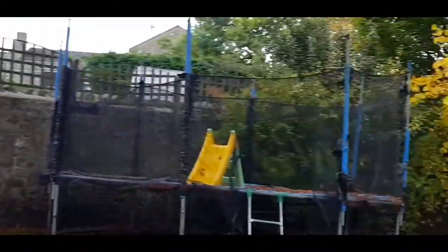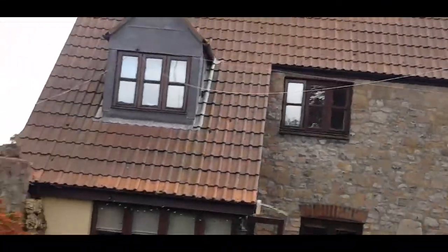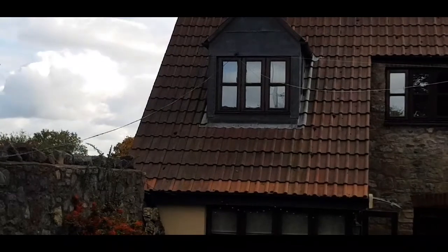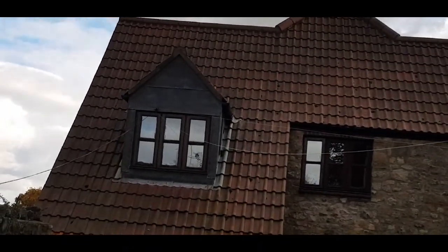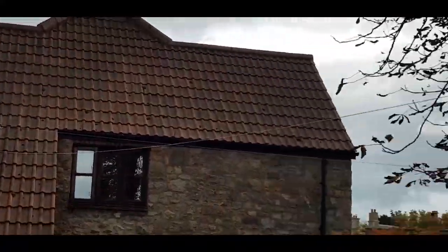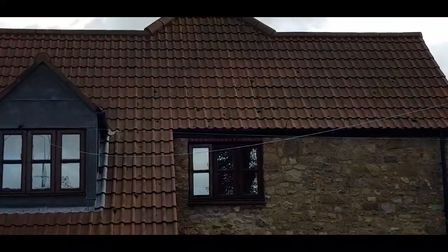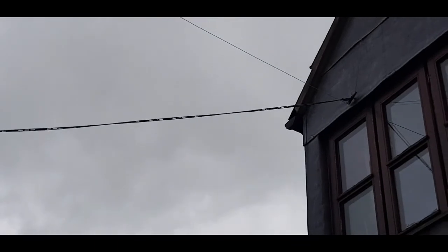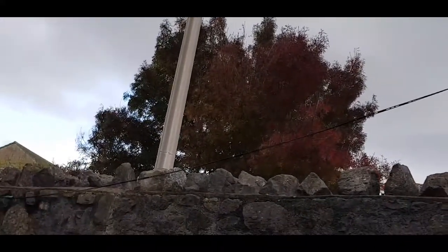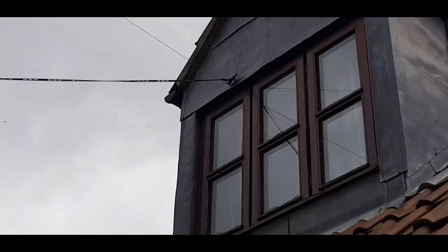It's quite hard to see it really. I've insulated the end of this, so if you look from a distance it's not great, but we know that this isn't the way you're meant to do it — but this is how I've done my G5RV. Having the two radial elements close together is very limiting on what I get, but I'm just going with what's easiest at home. With the G5RV, the twin feeder does radiate and receive, so technically the whole thing should be free in space and a lot higher than this, which is only about 20 foot.